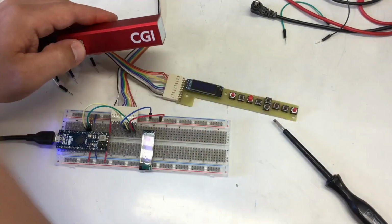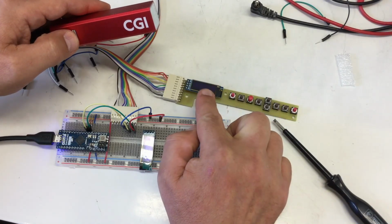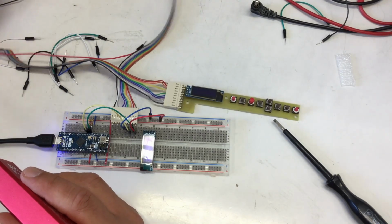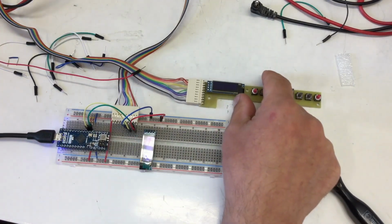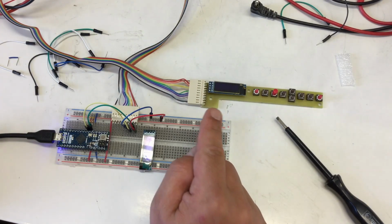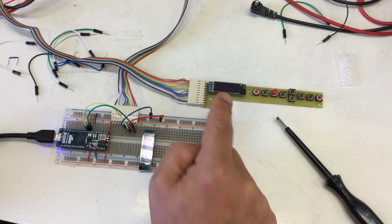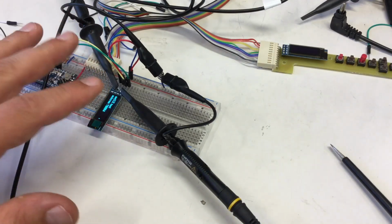Through static, maybe that foam pad was not ideal. Or, as an alternative, I give to you the signal through the quite long wire gets too distorted, the I2C signal. And that means I have to get the oscilloscope out and just compare the waveforms when running locally and running over there. So I hooked up the oscilloscope probes as good as I can,